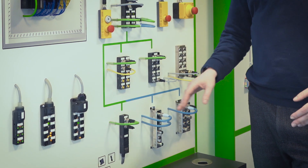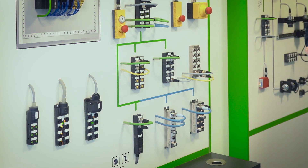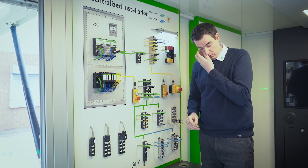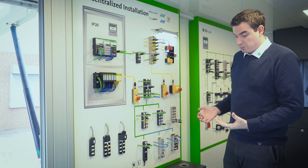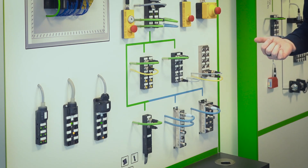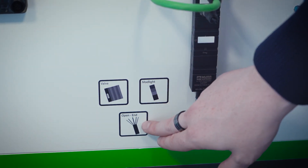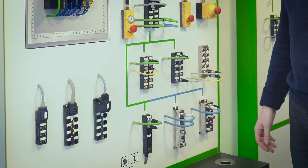We also have a range of valve terminals. These come with the classic 25-pin, 16-pin, and 32-pin D-sub connectors for any type of pneumatic valve bank or valve manifold you may have. We cater for all major suppliers — Bosch, Mack, Norgren, SMC, Festo, and others. We also have a communication direct to the Modline Pro system, or just an open-ended cable ready for wiring.